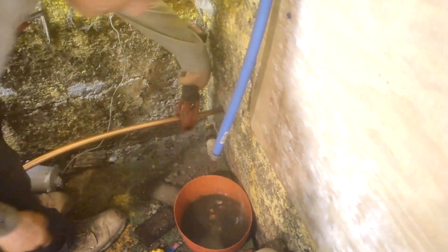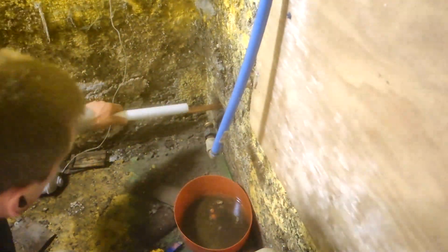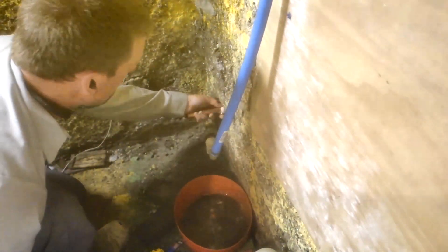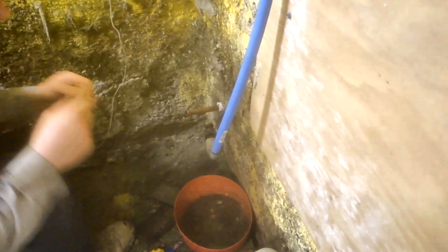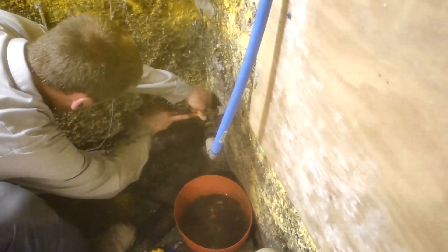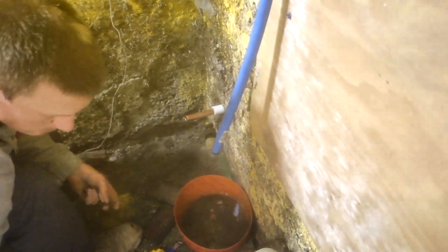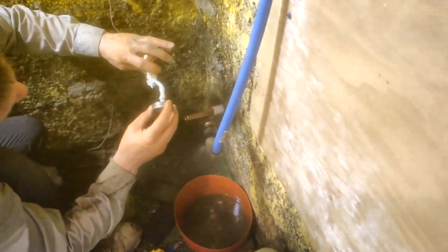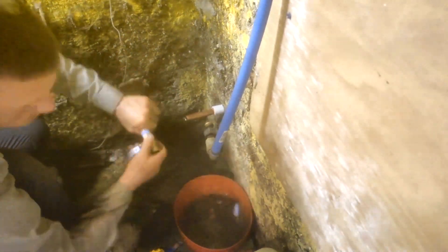Real quick — this is a new thing. I'm trying this voiceover at a later date because this job actually took place sometime last year. The point here is I'm trying to do voiceover for stuff that isn't self-explanatory. As you can see, I actually cut the copper and put a sleeve in there, because a little bit after this I fill that hole in with hydraulic cement to separate it from the copper. Always make sure to ream the inside of your copper pipe — that prevents cavitation as the water flows through it and prevents premature failure of the pipe and fitting. ProPress — I've heard it isn't allowed in some places directly on the service line, but nobody cares here and it makes it nice that we can actually do that.